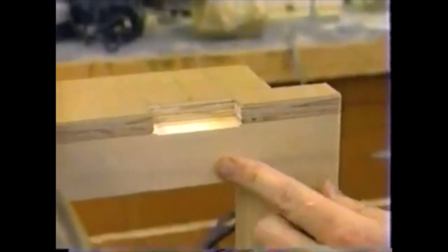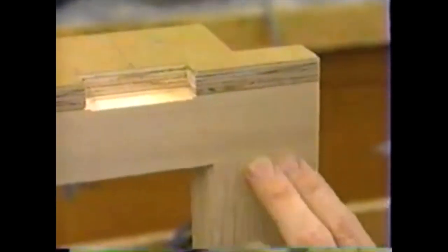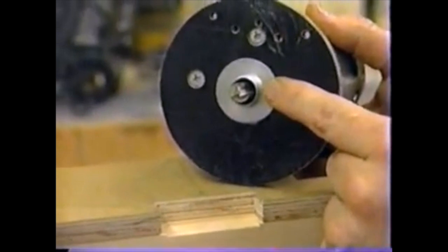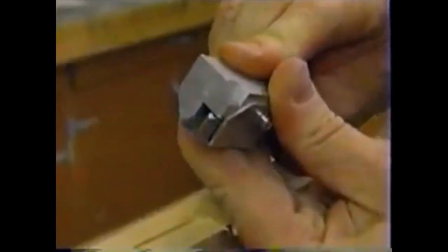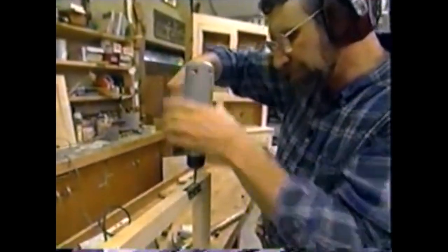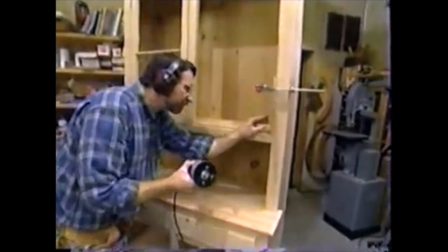Now we're ready to hang the doors, so I have to mortise out for the hinges. I sanded the doors smooth at the sander so all the joints are even. I made a small jig from half-inch plywood — the cutout is slightly bigger than the hinge to compensate for the difference between the collar size and the router bit size. After making the initial mortise, I remove the jig and square up the corners using this corner tool, which has a chisel that you set into the corner, tap with a hammer, and then remove the small piece of wood left behind. The hinge should fit perfectly and we're ready to attach it with screws. The same technique takes care of making the mortise in the stile.